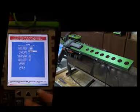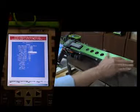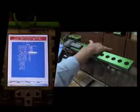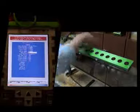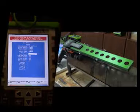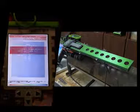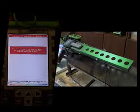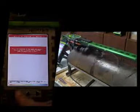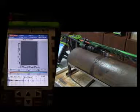Then we'll select the scan axis. We're going to be taking scans off the Y axis, so it'll actually move down the length — Y to the 9 inches, step over 50 thousandths, and come back, step over again and come back. So we're actually scanning that length of pipe instead of back and forth across the circumference. Data stored is going to be overwrite in case we end up with a lower or higher number someplace. Go up and accept it. Now we're going to place the position of the scanner itself on the pipe using the arrow keys left and right. We'll move that over to the back side of this pipe, to about there. Press Enter to accept and we can start the scan.